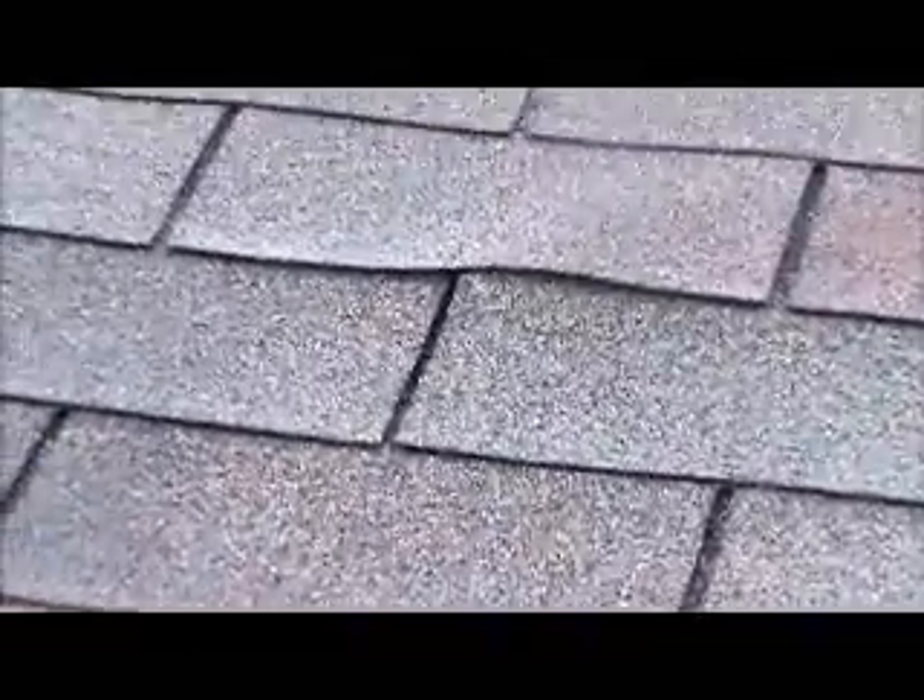This is the front of the roof. In this one section here, it looks like we have to renail the plywood underneath the shingles. And here it looks like it's just the shingle itself — right here.